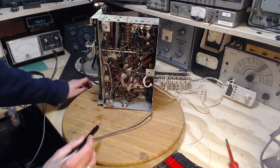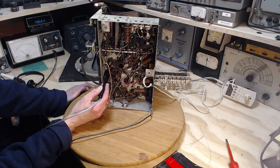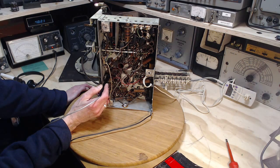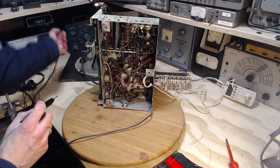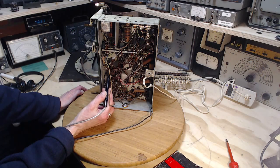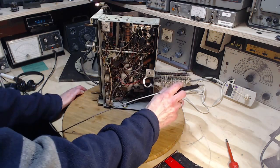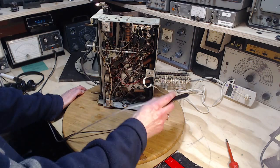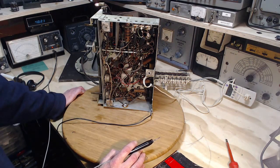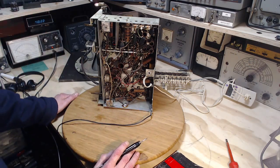First thing we're going to do is read on the power supply capacitor and make sure that there's something there. Doesn't look very good. I'm on the 500 volt scale. Well, that does not look good at all. Okay, actual voltage here. It's very low. About 60 volts. 60 volts. You see, and now this one's only 45 volts. That may not be enough to really get these tubes conducting. It could explain why when I do put full voltage on, I get heavy power consumption according to that meter. It's because there's something wrong, but at this point, the wrongness is not presenting itself very well because I have the radio working on such low voltage.